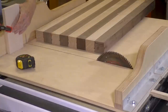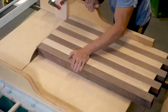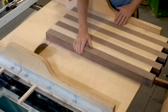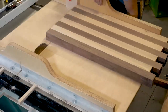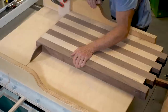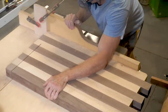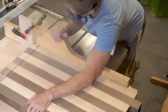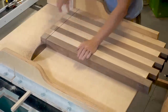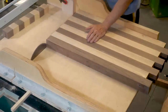The final board is going to be one and a half inches thick, so I'm setting my stop block a little bit further away from the blade than that to have room for sanding after it's all glued up. First I'll run the end of the board through the blade to square it up, and then I'll cut off the individual pieces. I have enough material here to make two chess boards — one with a walnut frame and the other with a slightly different design using a frame made from tiger maple.